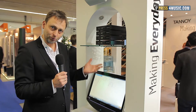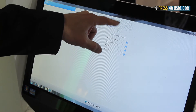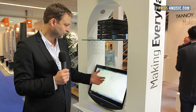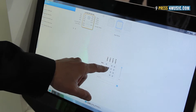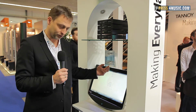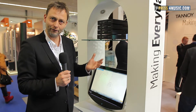Let's look into the software and what we can do. We have three main blocks: something related to the inputs, parts where you can select what the inputs are doing, and on the output side a matrix where you can mix four inputs together with two internal amplifier channels and two extra outputs that can be transmitted to two units that don't have the DSP.